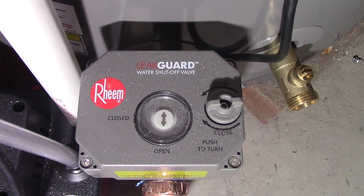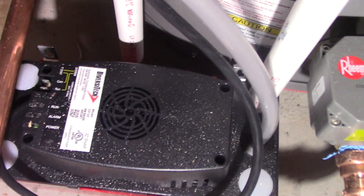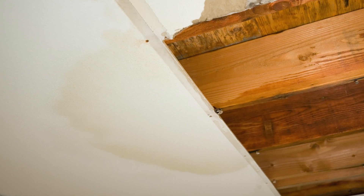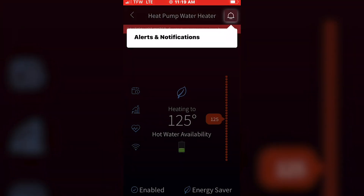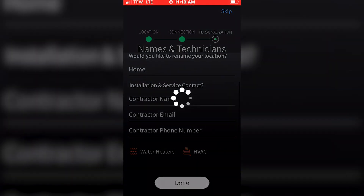There are also some cool safety features. This tank has a feature called Leak Guard Technology that senses water around the bottom of the tank — which could be triggered by a tank leak — and automatically shuts off the water supply to the tank. It also triggers an audible alarm on the tank and alerts you via your phone through the app. This is an awesome feature for anybody that has a water tank inside their living space as opposed to maybe in a basement, because if you get a water tank leak and you're not home to identify it, it can cause significant water damage to your home. If something does go wrong when you're not at home and it senses a leak, it'll shut off the water supply, so you're not going to have a continuous flow of water until you recognize it. You also get the alert on your phone so that you know if something's wrong. The app also alerts you for a series of other alarms, including if the temperature or pressure gets too high or the machine requires maintenance because of the heating elements or something like that. You can also forward these alarms to a plumber or service technician so they know in advance what the problem is going to be.